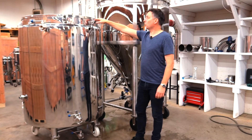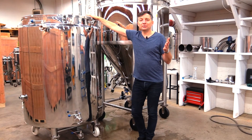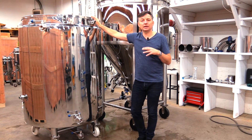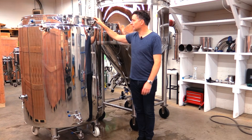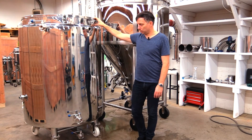There are a couple of ports on the top. If you're going to close the tank, make sure that you use a pressure and vacuum breaker, because with the heating and cooling of water inside, levels are going to change and pressures inside will fluctuate — so install a vacuum breaker or just leave the ports open. You also have a filling port and a pressure relief port.